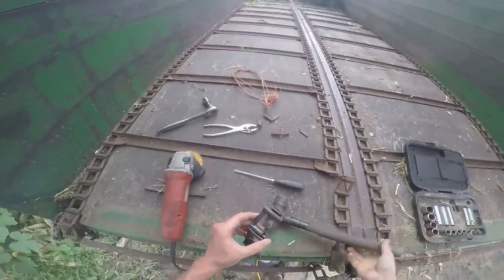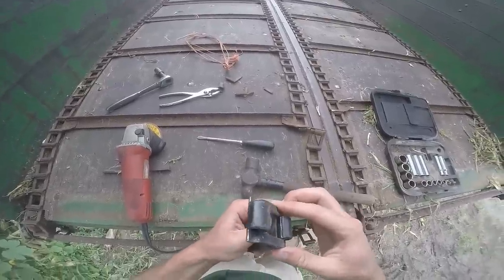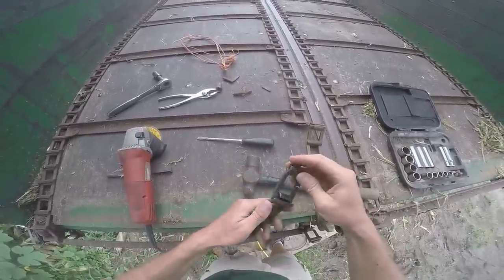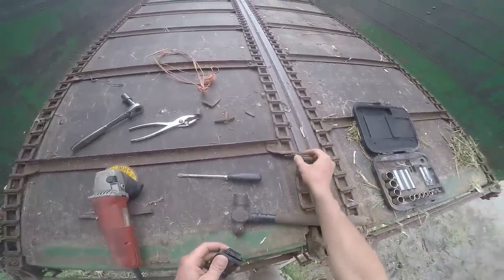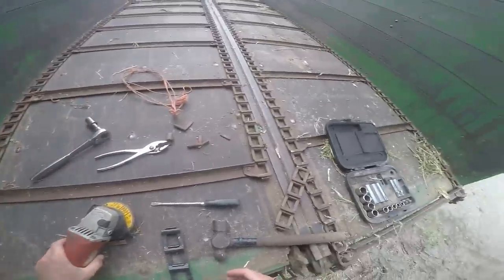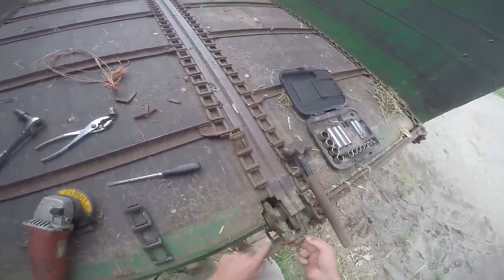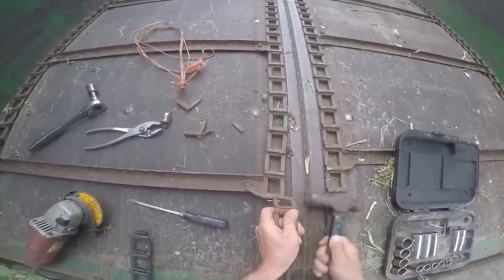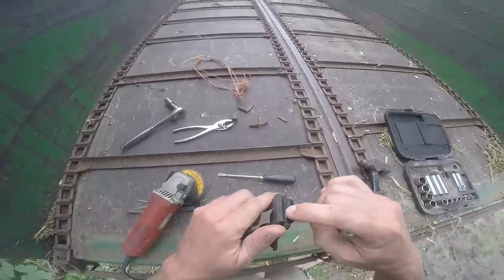When dealing with these flat links, they're a pain in the butt. I mean, they're nice in certain ways because you can individually add links. However, you're supposed to be able to slide these things apart. If you look really close - how much gap do you see? You don't. And how often does the chain find itself bent backwards? Will the chain ever fall out? Especially since this is such a slow motion chain. I've hopefully modified that opening a little wider by removing some of it with a grinder, so hopefully this will slide together nicely. The real hard part is when I go to link this thing back together close to these bars - just to have enough room to move. These flat links should be just that easy, but if you've got to fight and fight, just cut the little corner off to get you started, or make that gap wider.